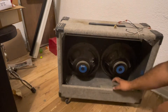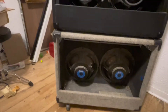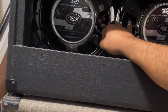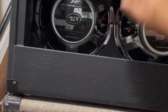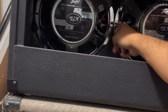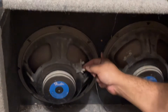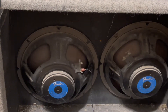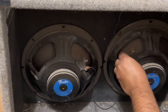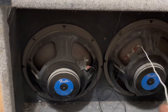So here we have the speakers — I need to take that reverb thing out of there at some point. On the JSX, zoom in real quick: right there you have your positive and your negative, and that's going on one side of this. They are split off into each speaker. Over here you're going from your positive into your negative with this little cable — we're gonna do the same exact thing right down here. Go ahead and get this done; I'm gonna put that one right here and find our other side — just like that, get one connected to our negative on that side.